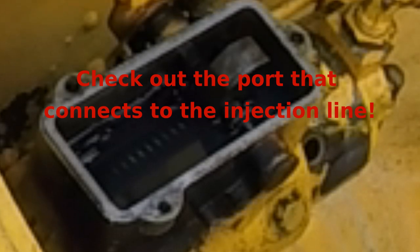Boy, again, I'm not seeing a whole lot. I would have expected that fuel to come shooting out of there by now. It is encouraging to see the bubbles, though. That is true. Yeah, this thing is working on that lift again. The solenoid isn't working. Yeah, that engine's working too hard at the moment. Starter motor's working too hard. That's got to be from the hydraulic system. It's certainly part of the problem.